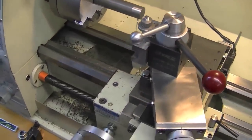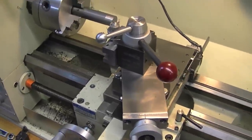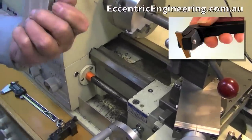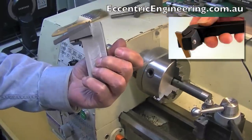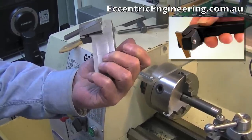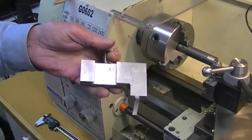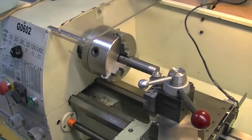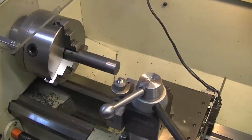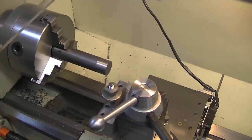So that was called a tangential shear tool. I have a tangential tool holder — I've got the diamond tool holder by Eccentric Engineering. But you made your own here. If you had it to do over, anything you'd change on your design? Probably, but this is the go-to tool. This is what I use for 80% of the work. I've noticed I get a much better finish using that than a regular high-speed steel tool. I'm going to have to go home and grind myself a tangential shear tool, because that looks pretty cool.